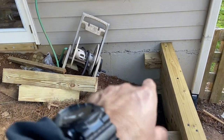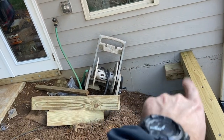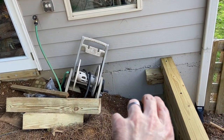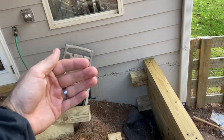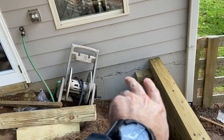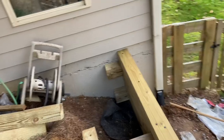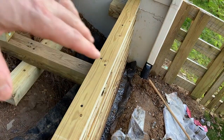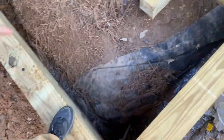I put two dead men there — each has a one-foot-long, half-inch rebar pin drilled into the concrete. I used a Bosch SDS hammer drill to drill two holes into the concrete and pinned the dead men in. Any force from the wall will pull against those pins — two per block, each pinned with rebar and a timber lock. As you build the wall you stair-step it back about a half inch each course, and I kept each course square to the house as I went up.